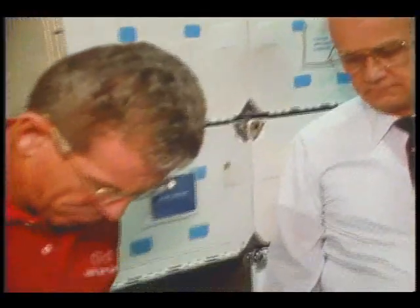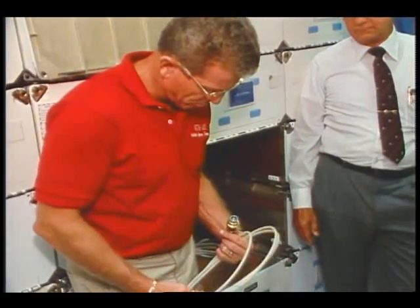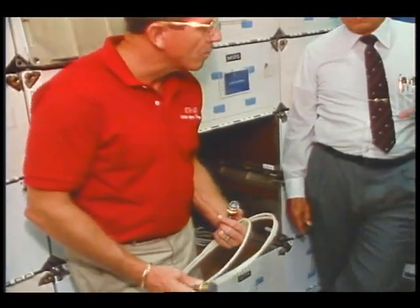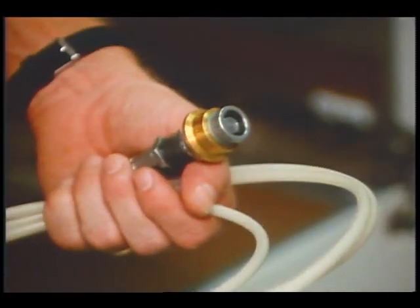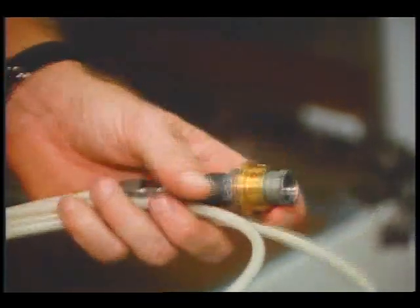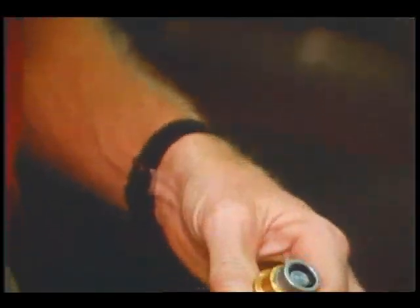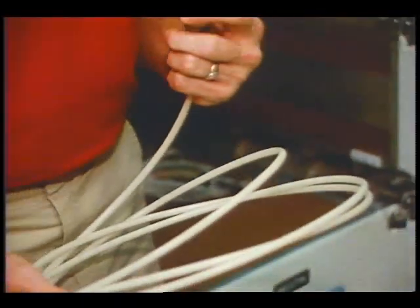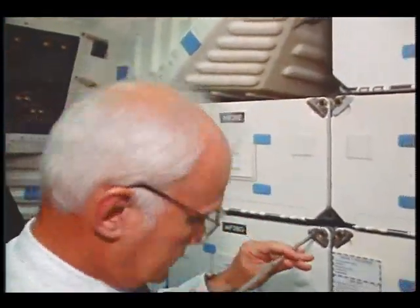So these are your two hoses that are for use with the potable water system. And there's a variety of QDs that we can access throughout the pre-module, and we'll look at those in a couple seconds. Your other hose is a yellow-yellow hose, because we got a couple of yellow bands. This one you can see fairly well; this one's rubbed out. Those are 3/8 inch nominal female QDs, and we can use those to mate with the wastewater system. We don't have any known written procedures to do it, but we could connect up to the coolant loops with that as well, perhaps if you had a leak and wanted to repressurize or refill the water loop after fixing the leak. We need to do that in all four corners.